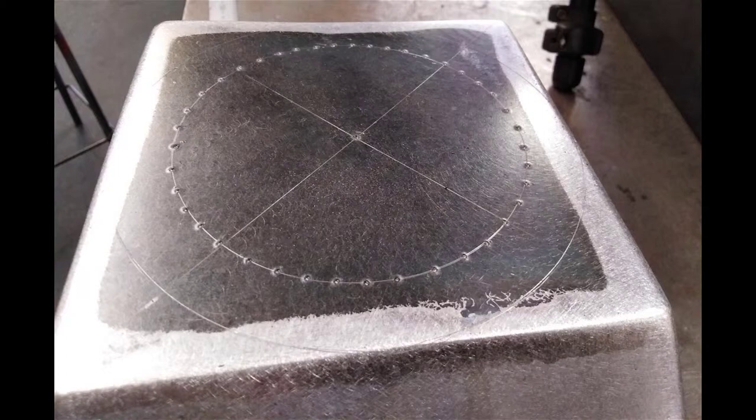One has a radius of 66 millimeters. That gives us an outside diameter of 132 millimeters. That is what the spigot will sit into. The spigot is 125 ID, and it's got a 6 millimeter, or two times the material thickness is 6 millimeters, so 131. So when you drop it into that 132 circle, you'll be able to see the line, which allows you to centralize it absolutely spot on.